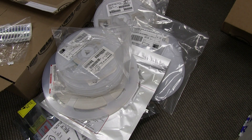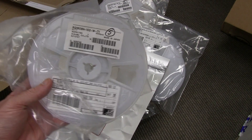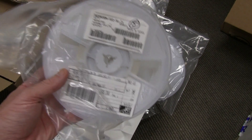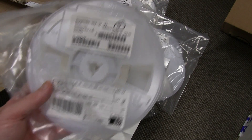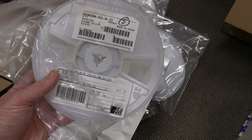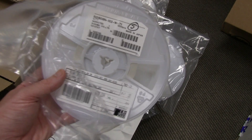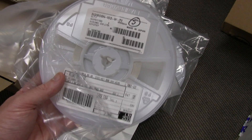One of the first things you have to do when you're preparing parts for manufacture at an assembly house like this is to make sure you buy everything in reels, even if you have to buy more than your allocated quantity. For example, I'm making 2,000 boards, but I might have to buy 3,000 of some parts because it only comes on reels of 1,000. Although you can, from the likes of Digikey and Mouser, get them re-reeled. You can use their re-reeling service - you pay like seven bucks or something and they'll give you the exact number of parts.